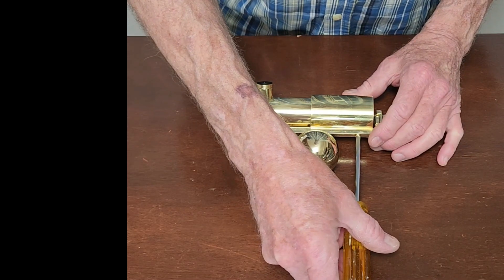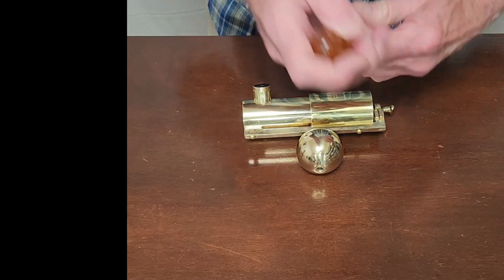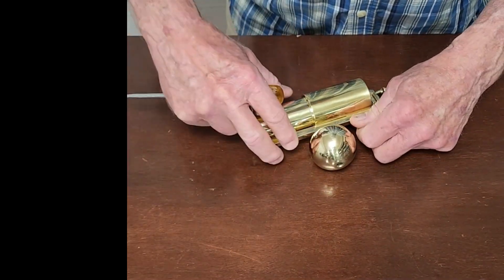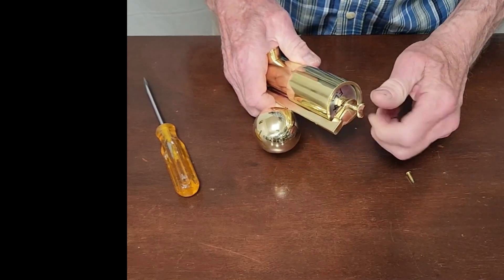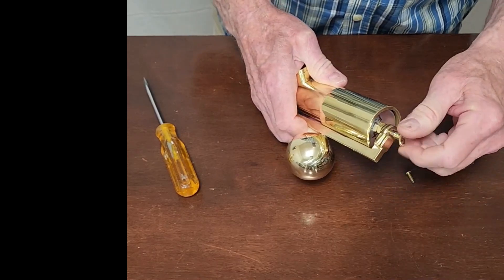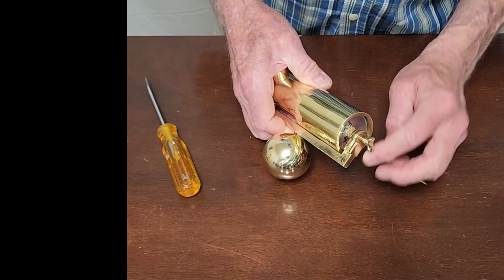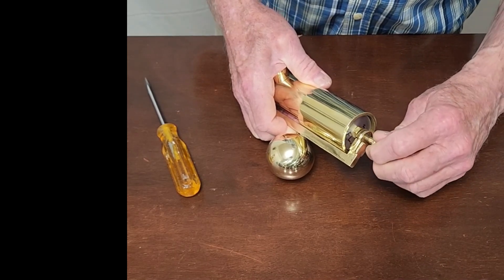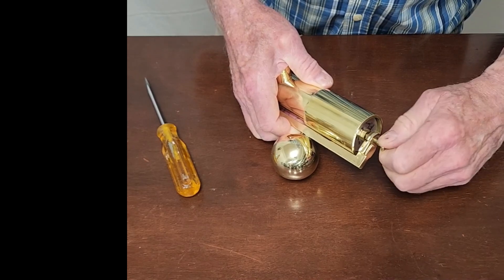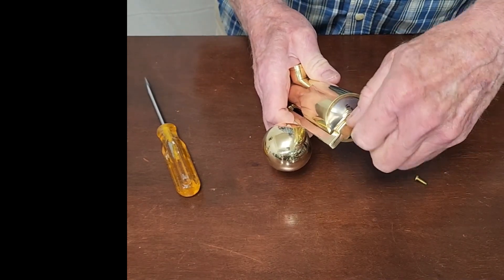Let me take this OTA apart and I'll show you what's inside. Like Newton's telescope, mine is in two parts. In Newton's telescope, this rear section would rotate. In mine, that section doesn't rotate, but the mirror itself rotates inside. The mirror is moving back and forth to focus the telescope. In order to make that work, I had to have a kind of coupling device here — more or less a trapped nut, free to move around a little bit, but staying in place enough to make the mirror turn inside the cylinder, kind of like a piston.